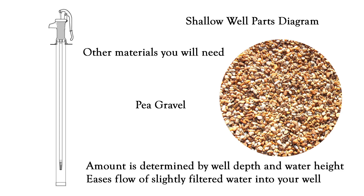You're also going to need pea gravel. This will go down around the casing pipe of your well, and the amount of pea gravel you'll need will be determined by how deep your well is. It will be put in and will need to come up to above the notches that you cut in the pipe to allow the water in. The main thing is don't put too little in — it's better to have too much than too little. This lets the water filter through and get into your pipe more easily.